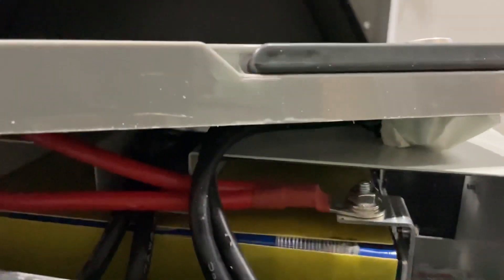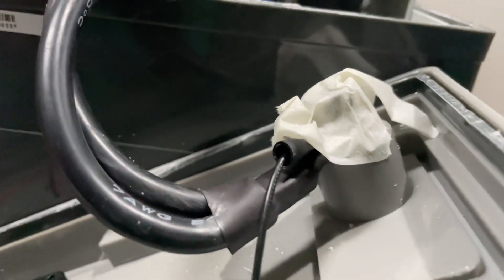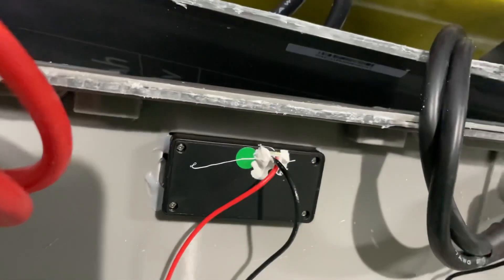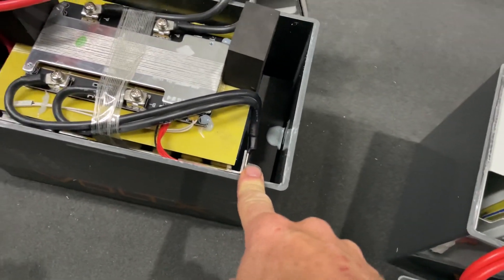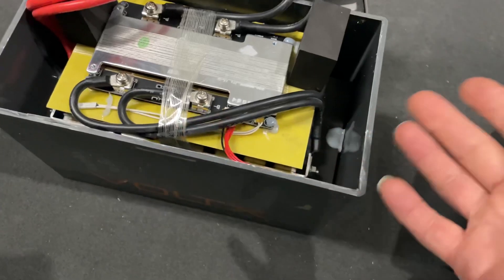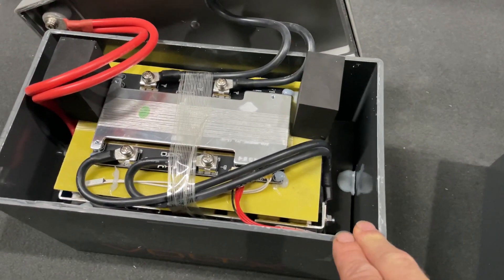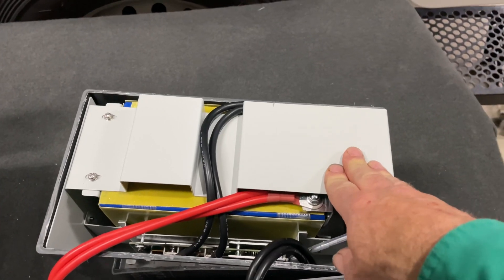The other really bad thing is when assembled, the negative cables rub onto the positive bus bar where the positive lead comes off — definitely a bit of a fail. They've done a job of putting insulating tape there, which is actually masking tape. Rubbish. The volt meter has just a bead of hot glue run around it and it's not sealed whatsoever. For them to claim IP65 splash rating — I cut this open and it actually vented pressure from gases that built up when assembled, so it was literally holding pressure inside the case.